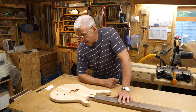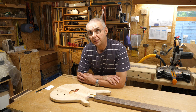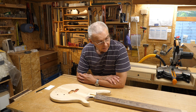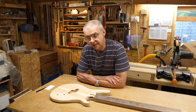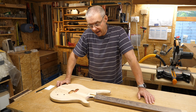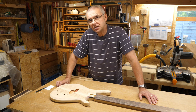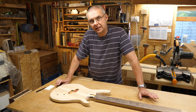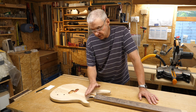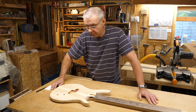So in the next episode I'm going to need to make myself another fret slotting jig, because the one I've got is for six string guitar, and I need a long neck bass one. So I've got an idea of how to make that, and I'm going to be making that in the next video. I'm going to use a bolt on neck for this guitar, like I've done with all my other guitars I've made recently. And I'm going to use a single roofing bolt, just exactly the same as I do with the six string guitars, and the dovetail joint that slots inside the body, because I'm convinced that is going to be able to support the pressure of the strings.